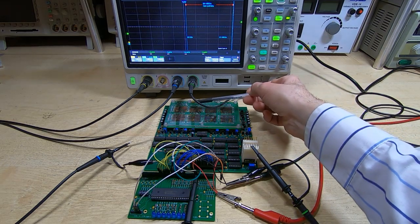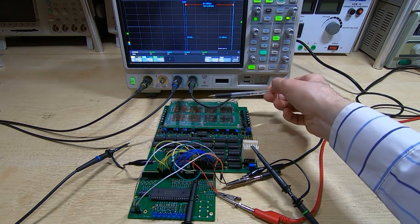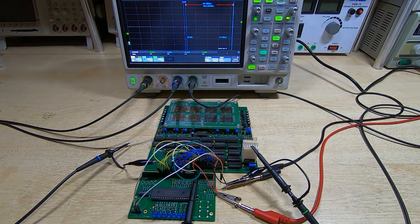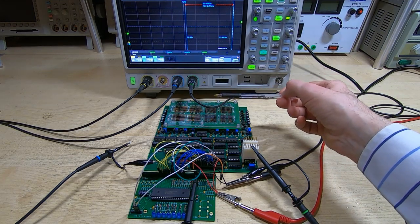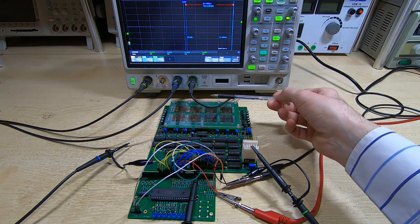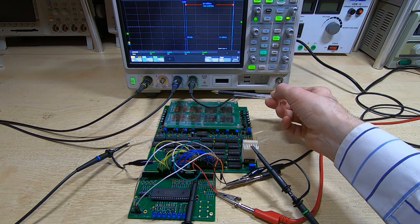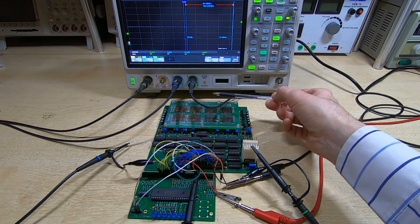So every single selection wire actually goes through 64 cores. And the interaction you will get depends on the bit pattern that is being applied to each of the mats. That in turn is cross-coupled to the inhibit wires and the sense wires, so there's a huge amount of interaction that we get. So we have variability because of the cores, we have variability because of the differences in the tolerances for the current drivers, both for the selection and the inhibit drivers.